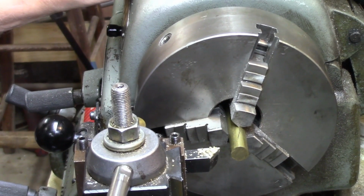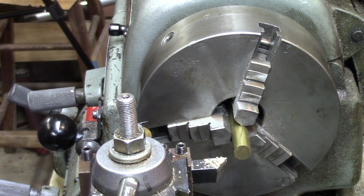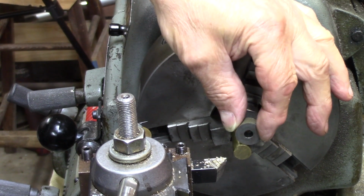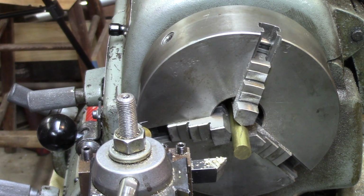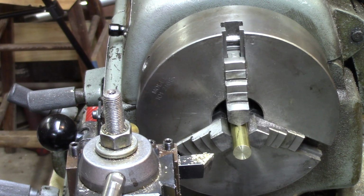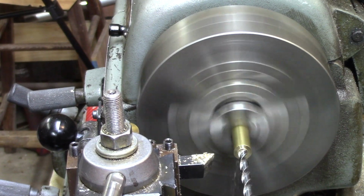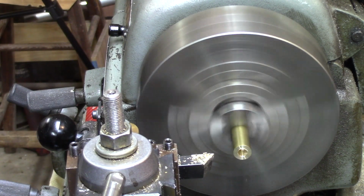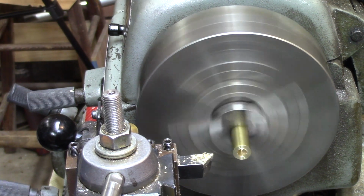This is about a half inch. It's about right. I held it up against the knurling rollers, and you can see that it's just about right. It's not going to get in their way, and everything should be lovely. And the hole won't make the edges so thin. That should do it. That should give me room for the parting tool and everything. You kind of clean it up there.